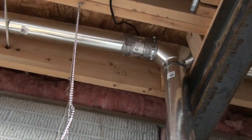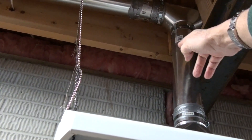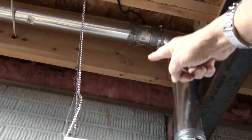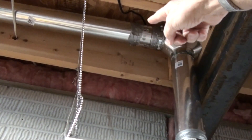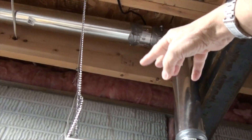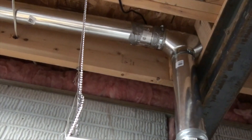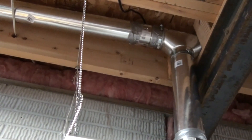In order to get the air going out from this pipe all the way out, I want it to go straight out towards the window. I don't want it to go back into the soldering area. So what I did — where I have the tape right there — in between them there is actually an inline fan, and the inline fan is directed this way. So when the air comes up from here it will go towards the fan and get sucked out towards the window. Same with the air coming from the other side from the soldering station — everything goes, with the help of the inline fan, directed to the window.